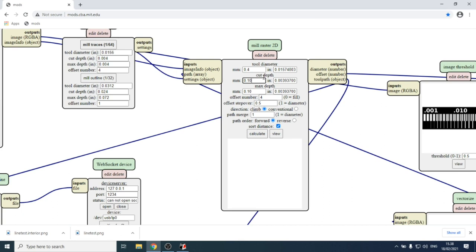The cut depth is set to 0.1 mm. If we set Z0 on top of the copper surface, the toolpath will cut 0.1 mm into the material and then move around to cut the unwanted copper. The max depth is set to the same value, but if you want to cut thicker material, you'd rarely do it in one pass. The cut depth is how deep you go in one single pass; max depth is the total material depth, and the algorithm calculates how many passes are needed.